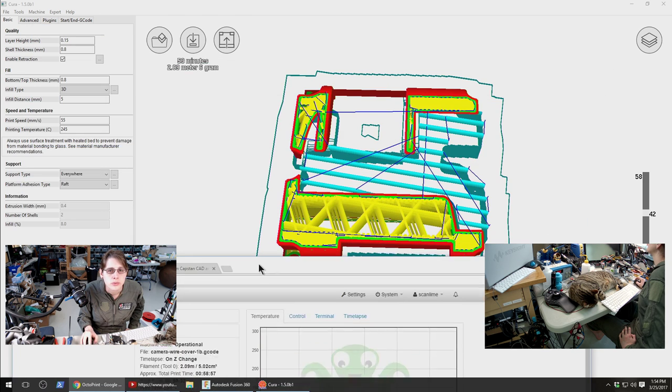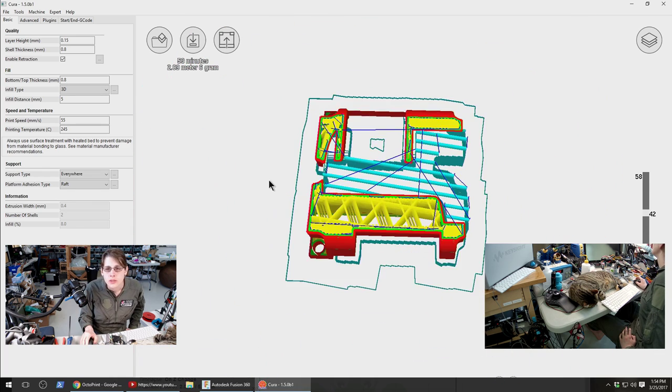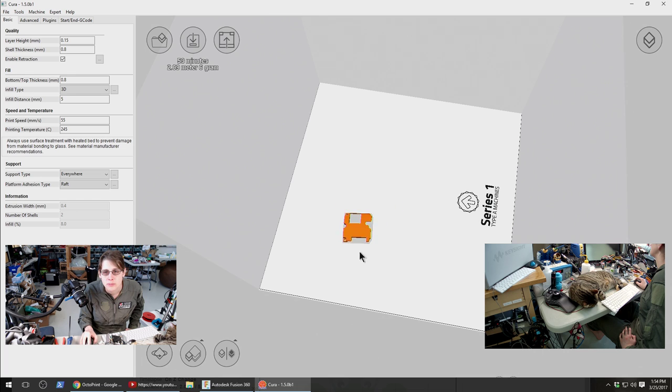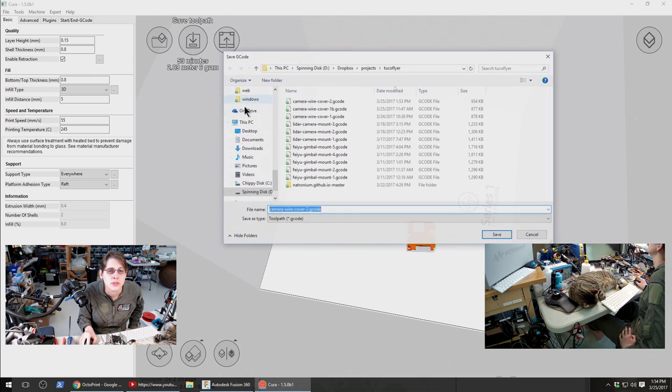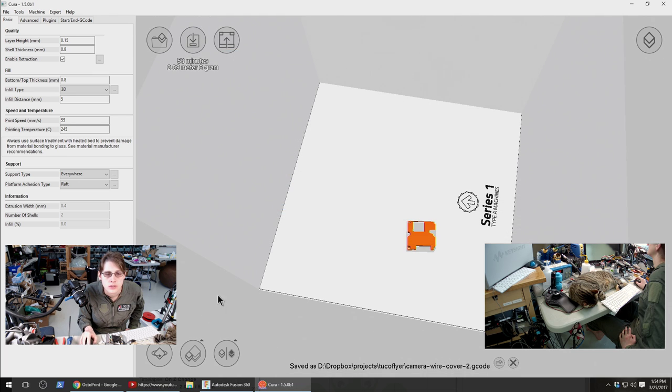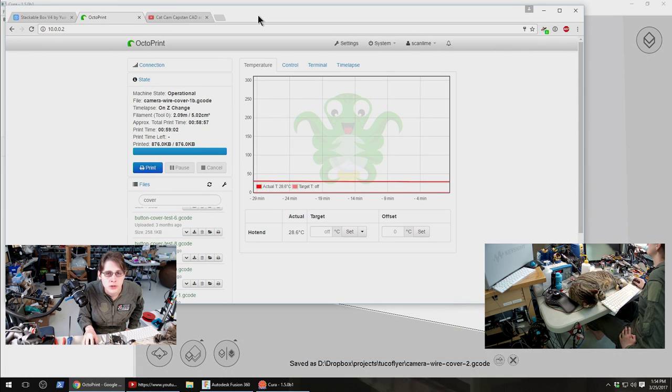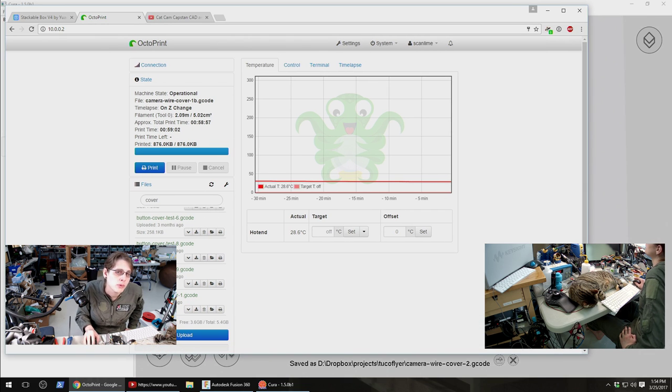I think I still need to clean the print bed, so... Oh, actually, I could save from cleaning the print bed by moving this around, which would also level the wear on my printer a little bit. So maybe let's stick that over there, and then re-upload that. With the PEI print bed coating I'm using, it sticks pretty well without having to reapply glue, but you do have to clean off the surface with isopropyl alcohol pretty much after every print for it to work. But you can cheat a little bit by moving the print around on the print bed so you're using a fresh portion.